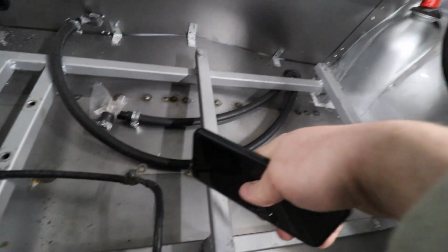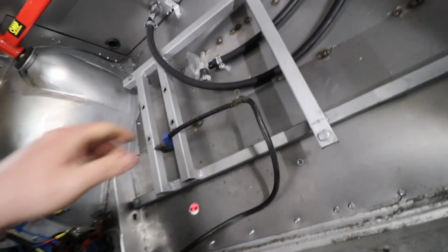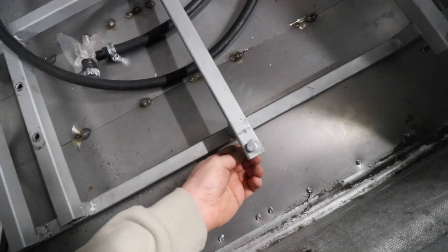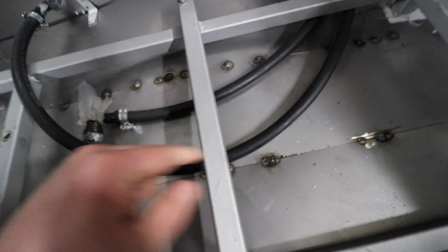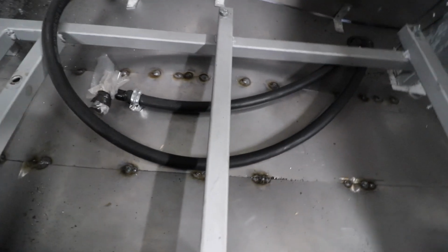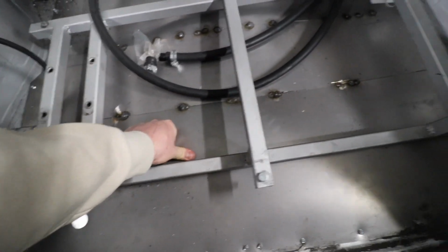These plates should really have some kind of profile to them, but I don't have time to, or I don't have the equipment, the tools to do it. So what I did was just welded the plates together, bolted and welded, so the plates would warp and the gaps would be tighter. So now it's almost no wobbling,